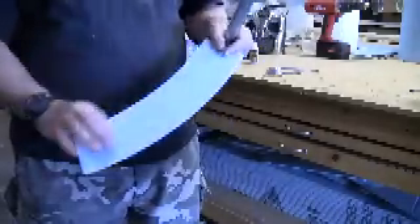Notice also that the skin film has been removed from the outside of the part, and that the outside of the part is the skinned side. The reason for that is because this is the flattest side — the inside is the one with all the wavy distortions on it, and we want to keep that away from people seeing it. I also have a piece of aluminum tube — I think this is 7/8 inch or something like that — nothing special, you can use PVC or whatever you want.